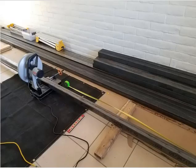We ended up buying 14 gauge, 3-inch by 3-inch posts, which we used everywhere. And they come in 24-foot sections. So I used my Evolution dry saw to go ahead and cut those into 8-foot sections. You can pay them to cut it up for you, but I was saving money. And in the background there, those are 1.5 by 1.5 inch 14 gauge that I'm going to use for the cross bracing. So we'll see that as we go.